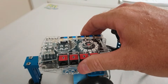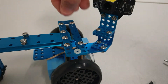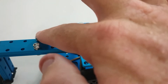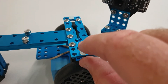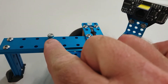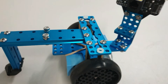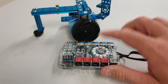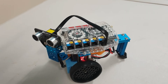Up here on top, when I mount it up on top, what I do is I put two of these little spacers — they also come standard in the kit — just like that, so it's going to sit flat down on the spacers on these heads, nice and evenly. If I didn't have the spacers there, there'd be a little gap, and as I did the screws up it would want to twist and bend the plastic and could break it. It was also sitting down quite tight here, and with the weight of it over the bumps it would try to bend it down and break it. So I've made sure I've supported the plastic case well over the whole robot so it can't twist. These corner bits can't be bolted down too tight. Okay, there he is, fully assembled with the top down.